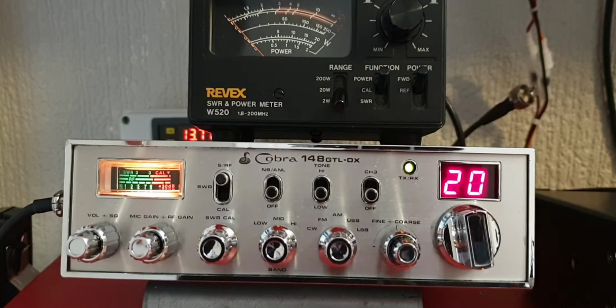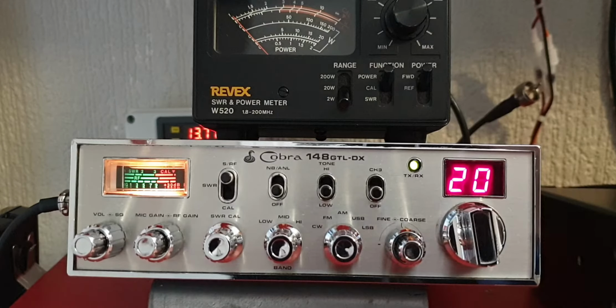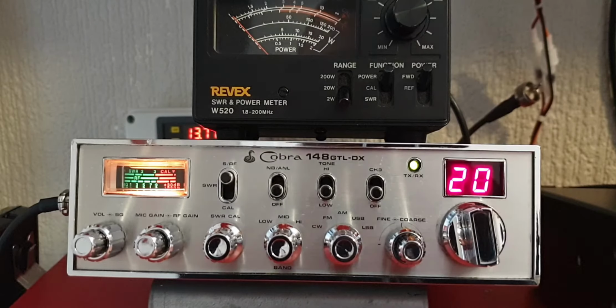So the radio goes from low block, which is 26.515 megahertz, to high block, so low, mid, high. High block goes to, that's the lowest, and the highest is 27.855. That's high block. So it's low, mid, high, 3 blocks of 40 channels. There's no alpha channels or anything like that. There's no 10 kc split. You can get about 5 kc on the clarifier there.